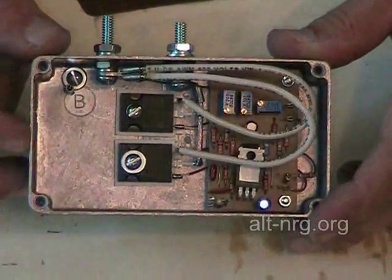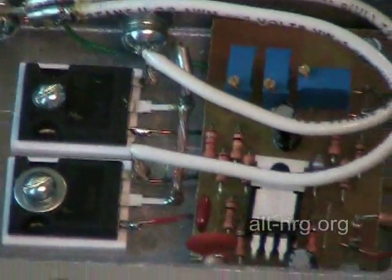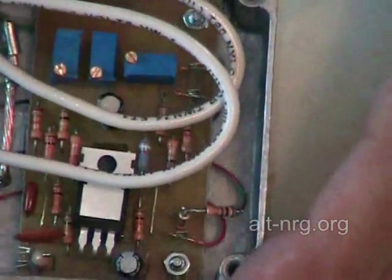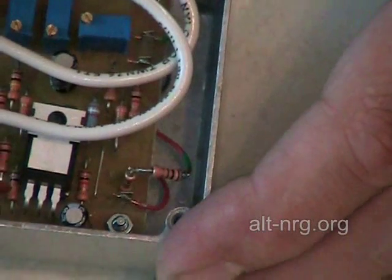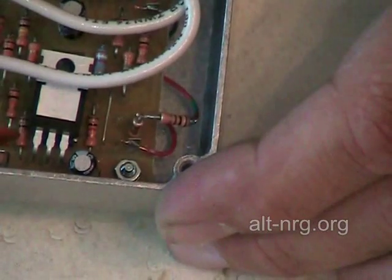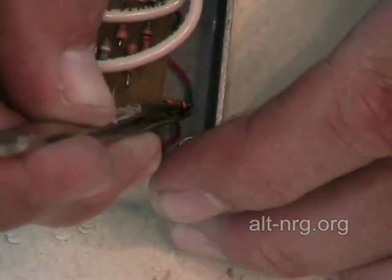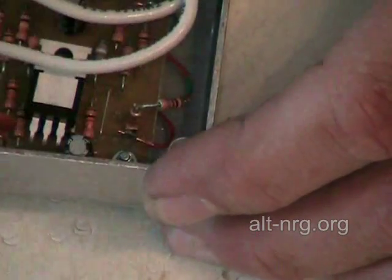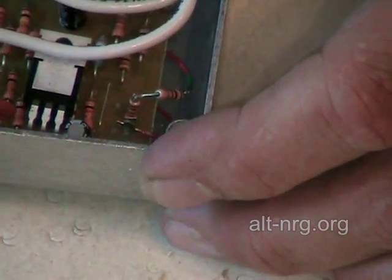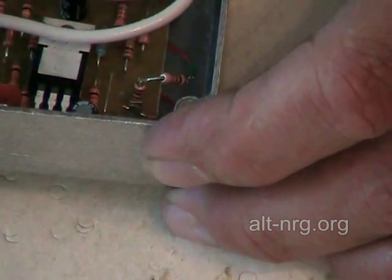You can see how that looks. The only other thing I want to point out is down inside you can see that dangling R9 that I have for the gate of power MOSFET 2. You just want to make sure you position that so there's no possibility it will short circuit to the side of the case, otherwise that power MOSFET will not work. It won't damage the circuit, but you just won't get the same current handling capability.